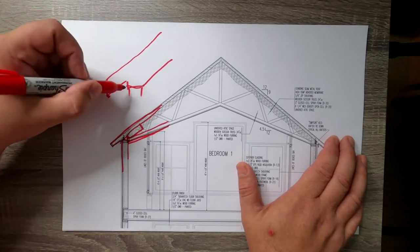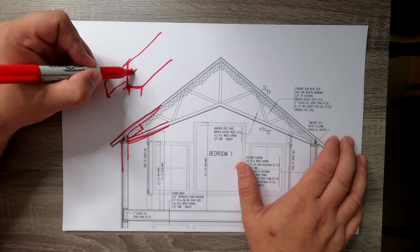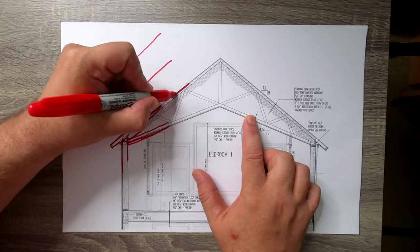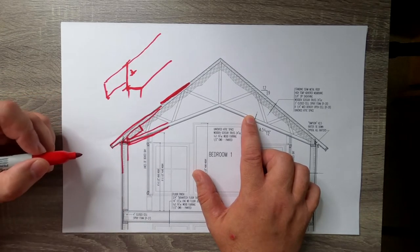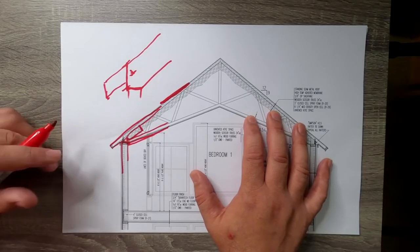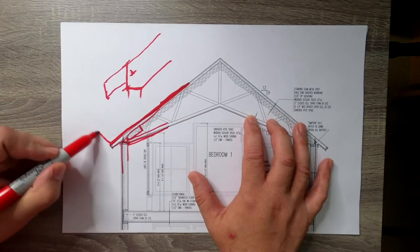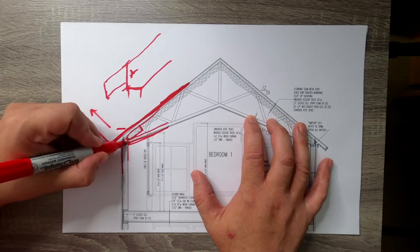That rafter had a heel height of some dimension — we'll call it Y. So when I set out and put these trusses in front of it, basically superimposing them on that cut roof, we need to match that up because a couple of things need to happen: the sheathing needs to plane out, and this corner needs to match up on top of the wall so we don't have a funky additive corner we're not liking. Most importantly, we needed to get that roof sheathing in the same plane across both roofs.